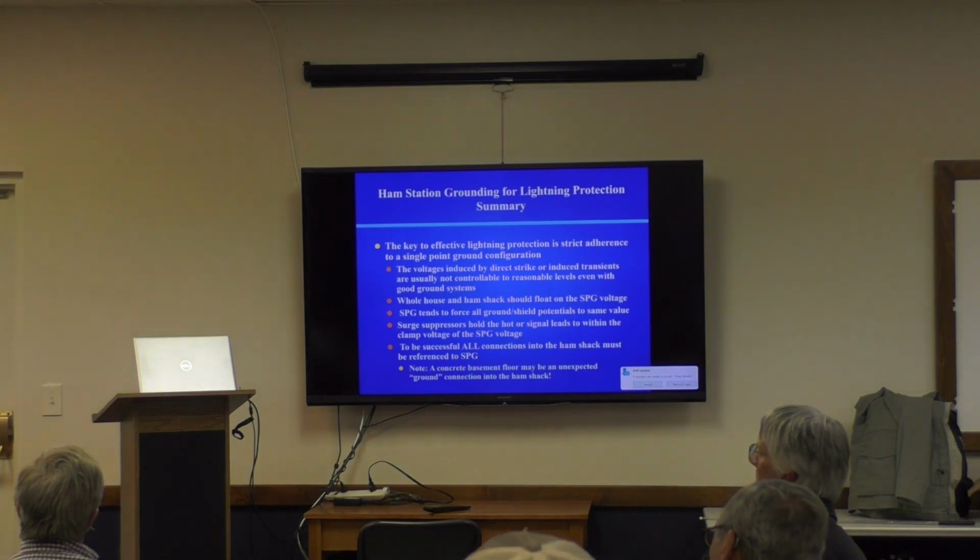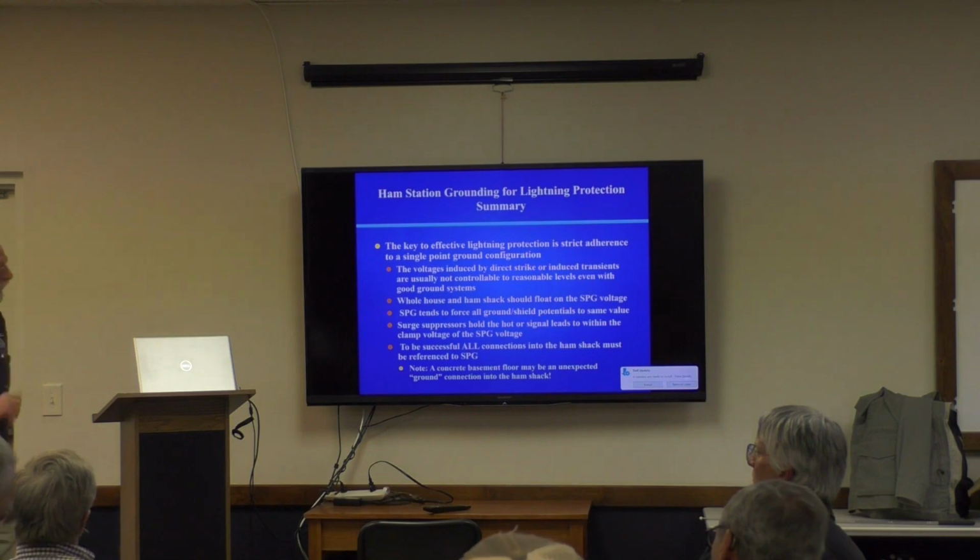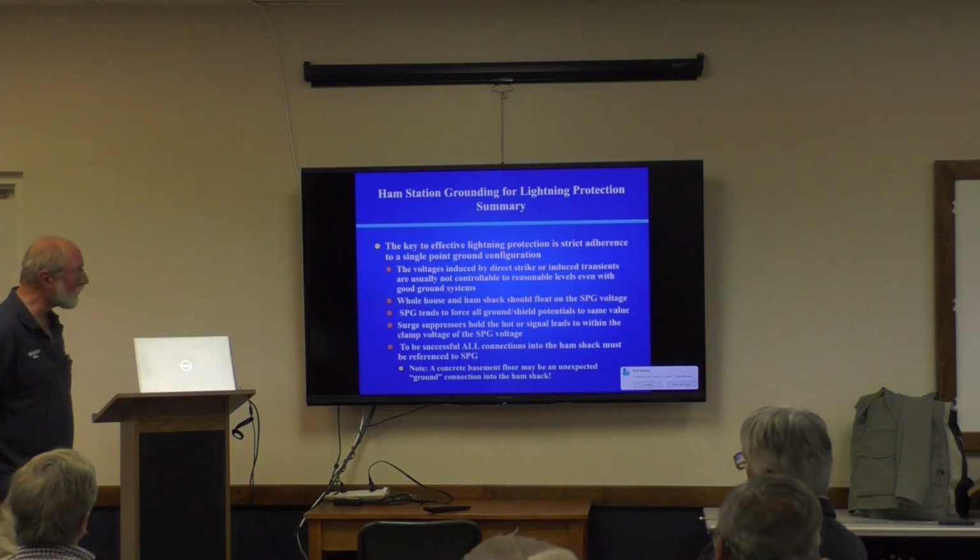Don't do that. Everything goes through the single point ground and needs to be surge suppressed to the single point ground. In other words, you have to do everything right to get this to work. You can't make any errors. Okay? But if you keep that in mind, you can do it.